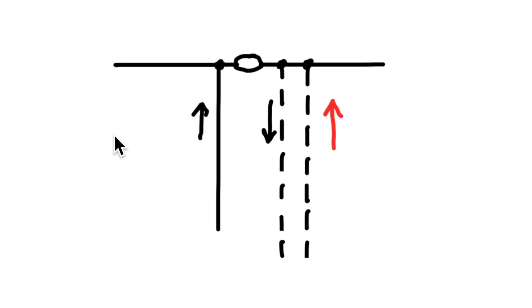When the system becomes unbalanced — the antenna is not balanced — things change. Because of skin effect, the inner and outer surfaces of the shield act as two separate conductors. This allows unwanted currents, represented by this red arrow, to appear on the outside of the coax. In effect, the coax cable now has three conductors: the inner, number one, number two, and number three. In transmit, these are stray return currents — part of your transmitted energy — taking a detour along the feed line and into the shack instead of staying in the antenna system.